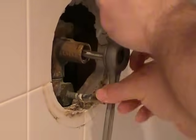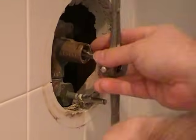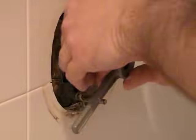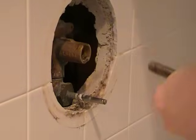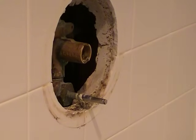Pull the tap back out carefully. Or turn the tap back out, rather. So now we got threads inside of the cartridge. And there's no going back now, because we've just destroyed our faucet if we can't get it out of there.